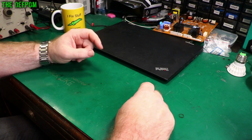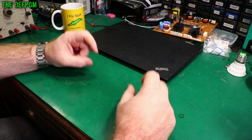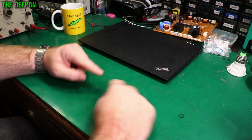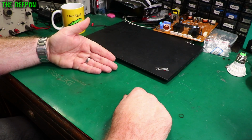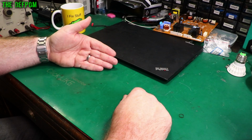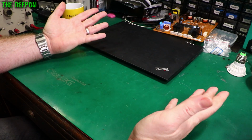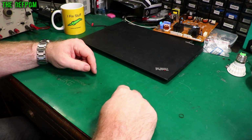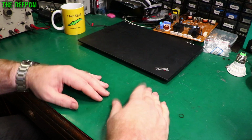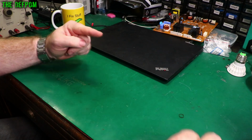Another really common part which you find using a lot is header pins. 0.1-inch header pins, or 2.54mm, whatever you want to use. Male and female headers, both single row and dual row, that sort of stuff. They get used quite a lot in lots of different things. Get some stock. Just get the long ones, and then you can cut them down to the length you need. It's easier that way, rather than getting specific lengths and finding you're 1 pin short. Just get the 40 pin versions and cut them down. You use a lot of those.